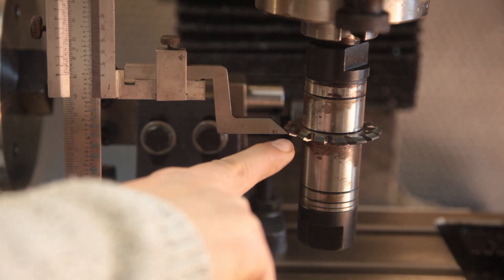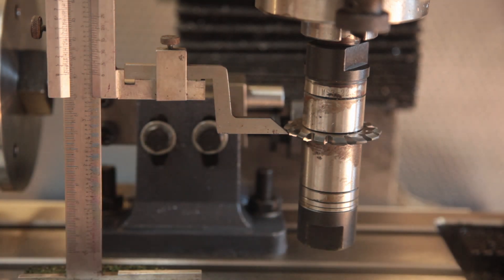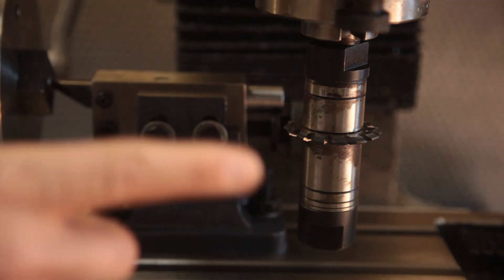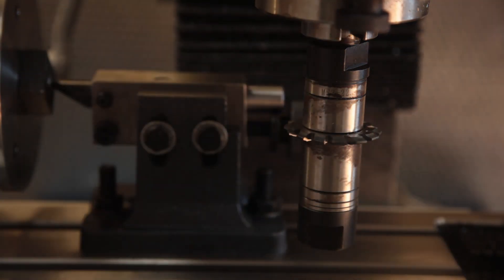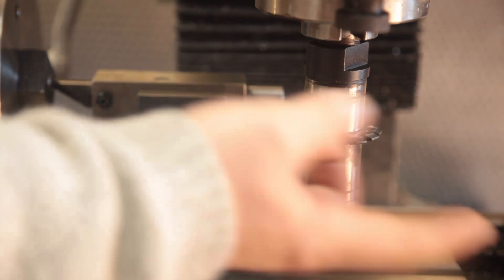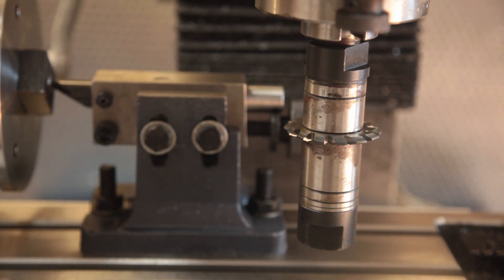As you can see, for that on-center height, it's the calculated height — actually right on the calculated height, which is quite surprising. I was expecting that to be a little bit out. So anyway, let's get this one out of the way. I've already got my depth of cut set. I'm going to do these in one pass. I will be running the gear counterclockwise, simply because it happens to face that way when you put it in, as per manufacturer's directions.